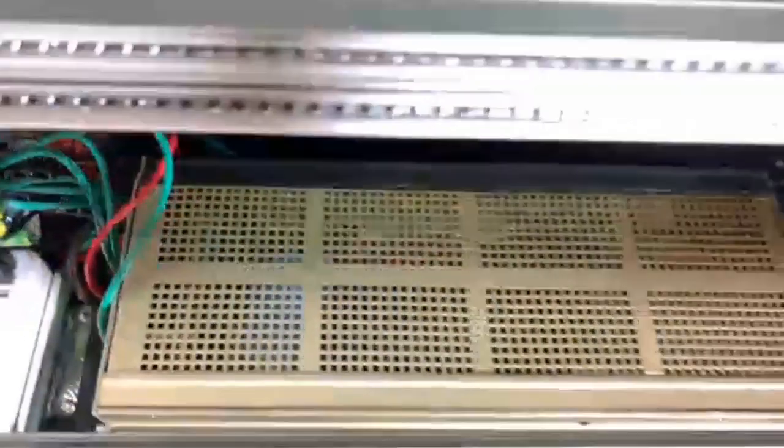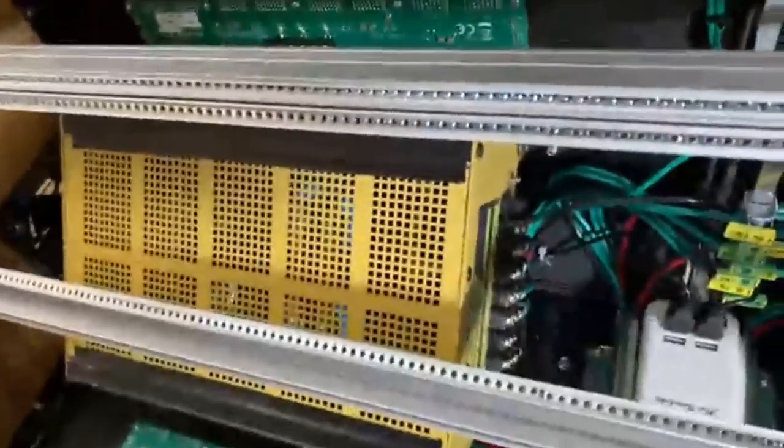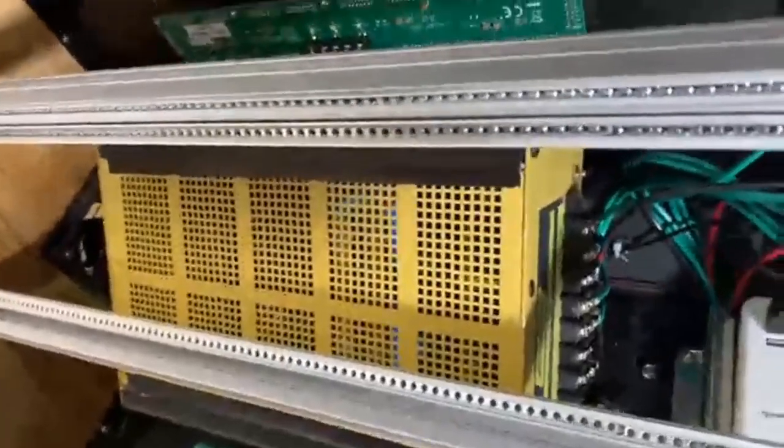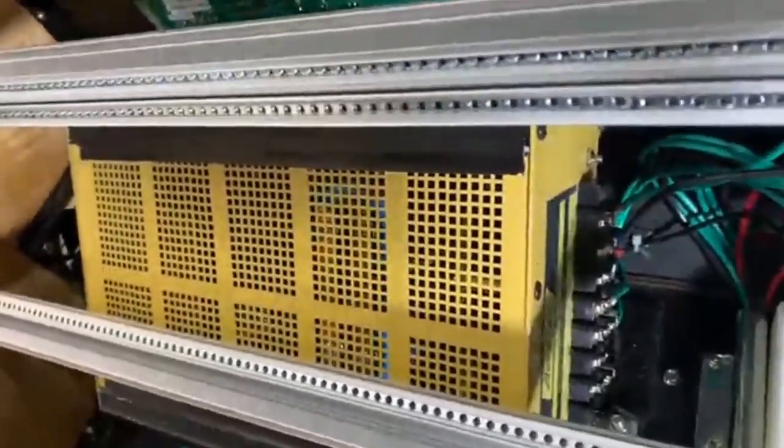These linear power supplies are known to only be about 50% efficient. Oh, wow. So half the power is going to go to the modules, and the other half is going to become heat. Right, okay. So that's not just a case of leaving headroom for the initial inrush, that initial pull that is larger than the idle state. That's just, they're 50% efficient. Yeah, I don't want to stress them. And actually that inefficiency is taken into account in what the output is.